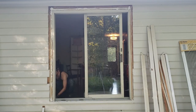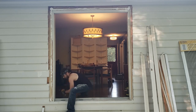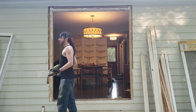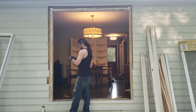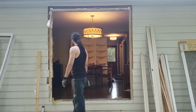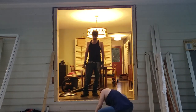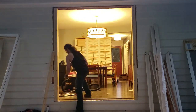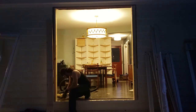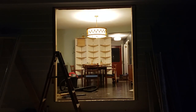The following footage was a lesson for me. There is a time and a place for being miserly and saving money, but buying a used sliding glass door isn't one of them. Here I am actually removing the sliding glass door we wound up installing, which we bought for $50, and framing it out for a brand new one. You can't really tell what condition a used door is in until you install it — and then you find out it barely slides, the bearings are shot, and its frame is basically mostly rotted out. Any money I wound up saving was completely cancelled out by the three-fold amount of time we had to spend rectifying the issue. Either way, here we are framing it out for the new door, which is smaller in dimension, adding 2x4s until it's roughly the same size as the new frame.